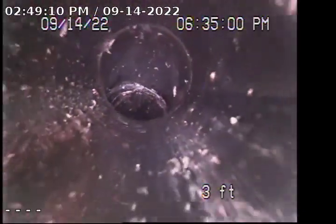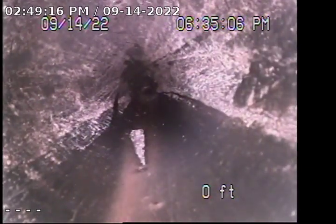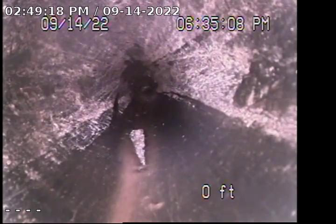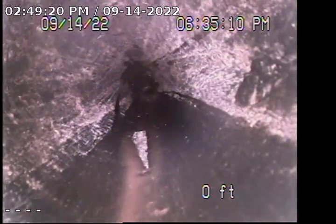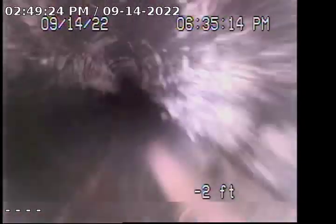So this was essentially put too high — they just had it too flat. The pipe is too flat; they needed to slant it a little bit more. That could have been fixed by either lowering that connection over there or raising this higher.